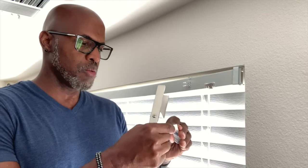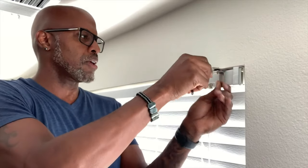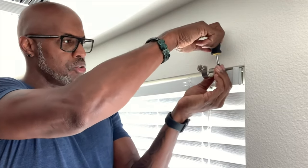If it's a little loose and you feel you need one or two strips, you can add both of them. Add the strip to the bottom of the bracket, then slide it in. Loosen the top screw a bit, slide that in, and tighten down. Sometimes one strip is enough — two can make screwing difficult. Add brackets to the other end, and depending on window size you may need one in the middle to prevent sagging. Put your rod and curtain on and you're good to go.